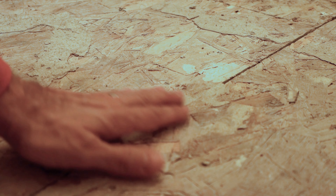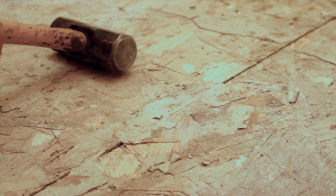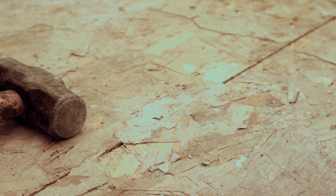After you've got all the tile and backer board removed, the next thing is to get the surface level so you can put the new backer board down. Depending on when the tile was installed — in the 90s they used adhesive and finishing nails to hold it down. You're going to see those sticking up all over. You need to go through the floor and pound in or remove any of those. You can pull them up with a screwdriver, or simply hammer them down. If the backer board is from the last 10-20 years, they used backer board screws — in that case just use your impact driver to zip those out. Go through the entire area and take care of all the nails or screws.